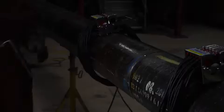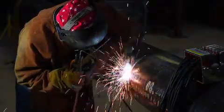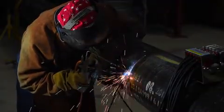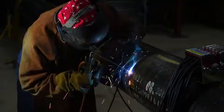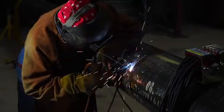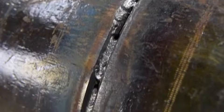Stage 4: Welding a magnetised pipe nulled by ZeroMag. The welder is set up and ready to weld. This time you can see that the welder had no problem striking a consistent arc. Welding progressed smoothly and the welding sound was even. Inspection of the weld shows a good quality weld with good penetration. That's how easy it is to overcome arc blow with magnetic field nulling using ZeroMag.